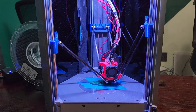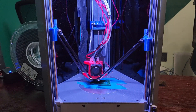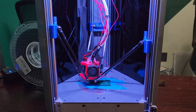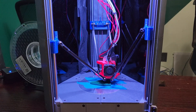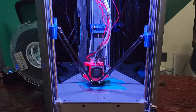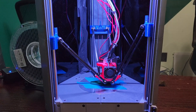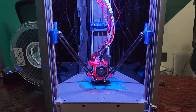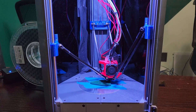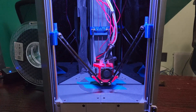As you can see, it's printing away here — I'm printing a Rook part, which is really fun to watch. This printer is fully encloseable; I have the DXF files for all the panels on Printables. There are very few mechanical parts and it's easy to route the belts — just a very enjoyable printer to build. I've printed this all in ABS, but if you're not enclosing it you can use PLA, that will be totally fine. It does have a heated bed by default, though mine never showed up on AliExpress so I'm using painters tape, which works great.